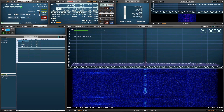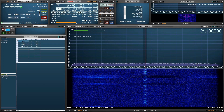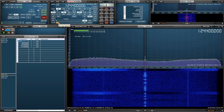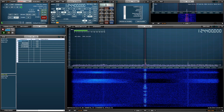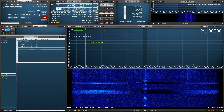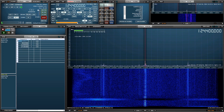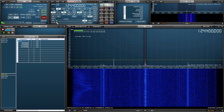So to start, I'm going to go off mute and we'll listen to antenna A, the flowerpot antenna. That was a pretty good signal — pretty clear and easy to hear. Now let's switch to antenna B, the rabbit ears. Notice that the signal-to-noise ratio dropped from around 22 to around 12. You can tell that the signal is much less easy to understand — much poorer quality.